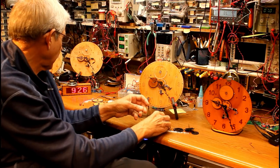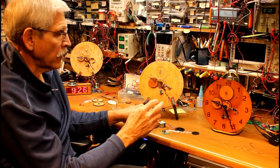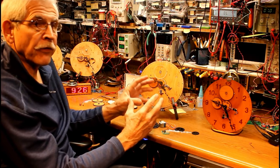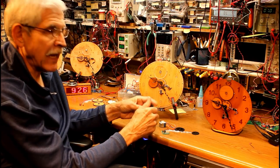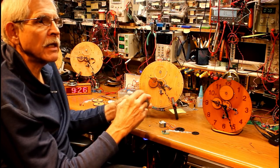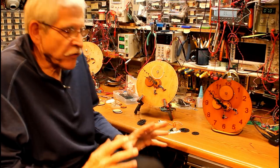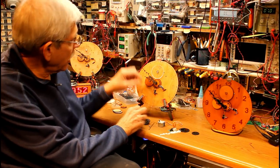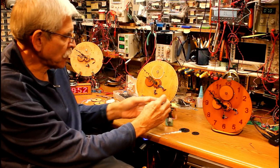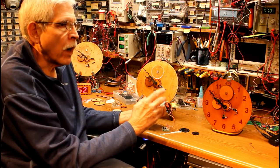So it occurred to me one morning, I'm making my own gears — these gears were cut on a laser cutter. Why couldn't I have two gears, one with 512 teeth on the stepper motor, another one with 360 teeth on the shaft that turns the hands? That way, when 360 steps are taken on the stepper motor, it turns the smaller gear on the brass shaft one full revolution. Problem solved. So switching from one-to-one gears to a 512-to-360 ratio allows the software to command 360 steps, which turns the inner gear one complete revolution.